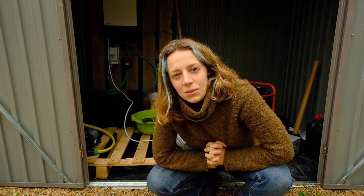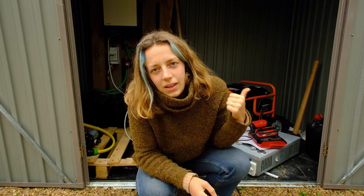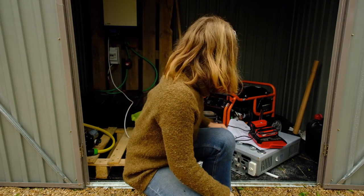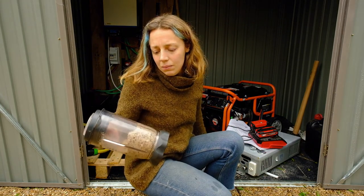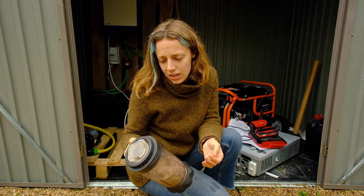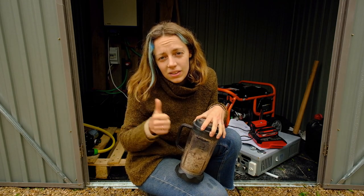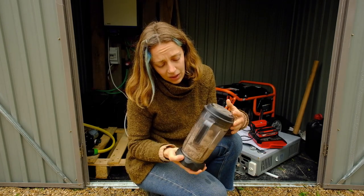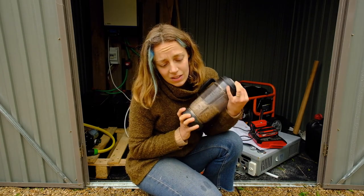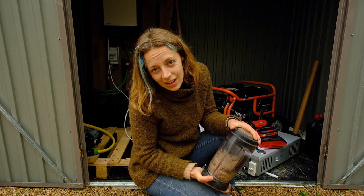Okay, I've had a nap and some lunch and I'm feeling better. Let's try this instant water heater and see if it can work. I've tried pretty much everything with the generator — nothing that we've found online seems to be working. I even tried plugging in a blender at the same time as the inverter to try to regulate the voltage output of the generator, since some people say it might be too unstable for the inverter. But it didn't work. I did manage to grind up a lot of almonds though, so at least I've got some almond flour.